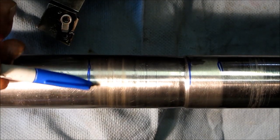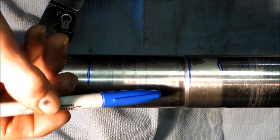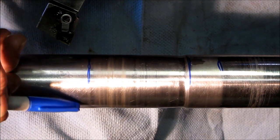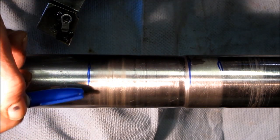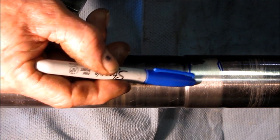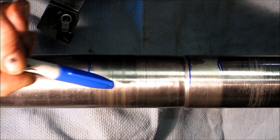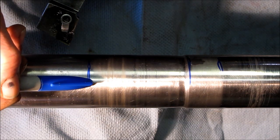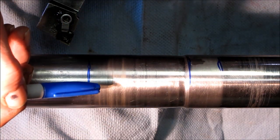Our laid out lines here — this is where we're going to start to cut. We're only a few thousandths under here, but if we're going to be welding this in, we found good diameter on the shaft here, or as good as we can for the next six inches or so. Right here is the extreme point of depth, and we're going to go just a little bit past that. We're giving ourselves a uniform diameter to work with, taking it down to close to this diameter right here.